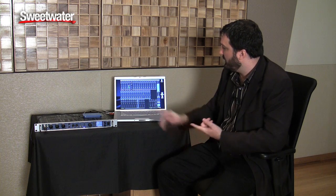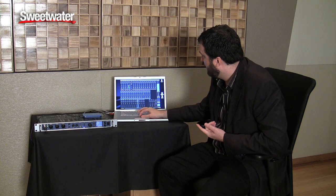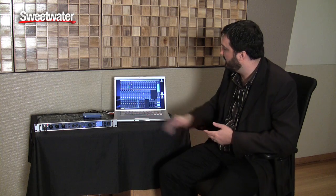Some of the really interesting new features we wanted to talk about today: we've just pushed out a new update for TotalMix FX that adds AutoSet, which allows us to take a mic preamp and, in case we're just setting up our mics quickly — we have four mic preamps up here — we hit an AutoSet button and it automatically reduces the gain to give you 6dB of headroom for your recording. It makes it very simple to quickly set up a mic system for a live situation.